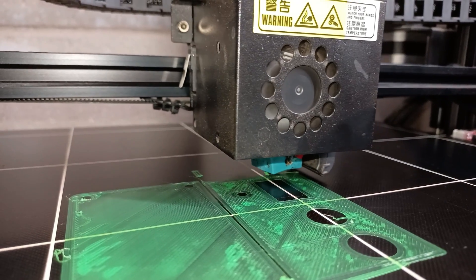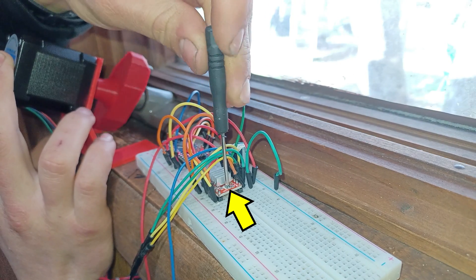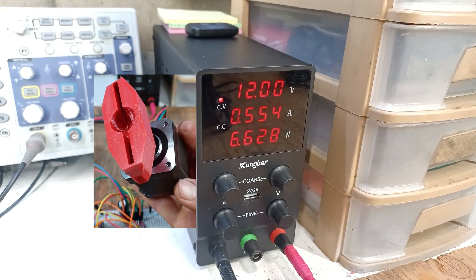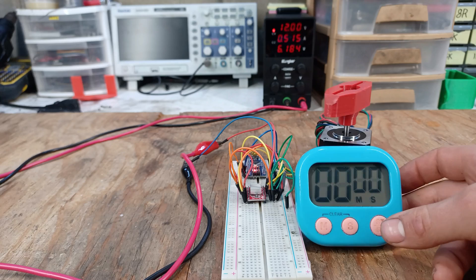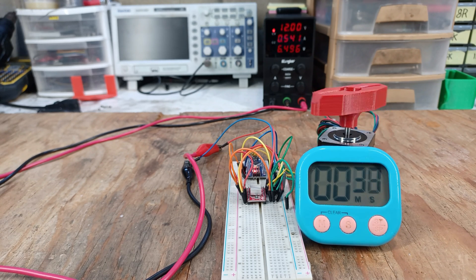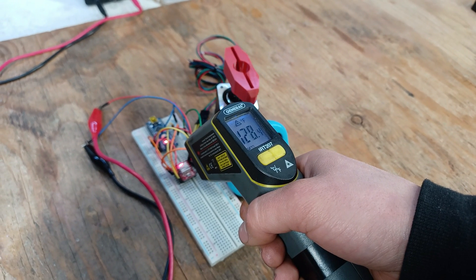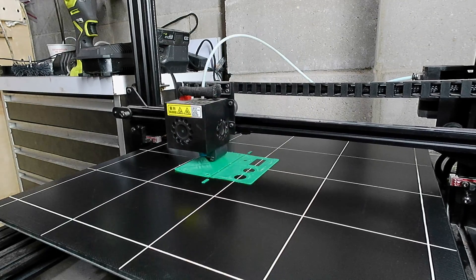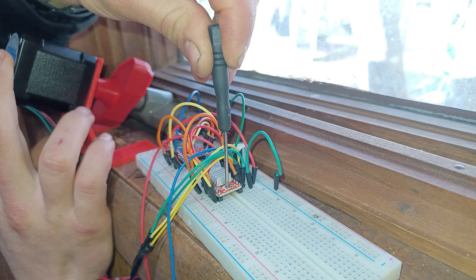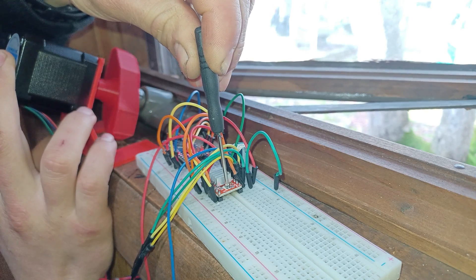As it is printing, I have to mention that the motor driver has a current regulation feature. Stepper motors draw constant current even when not under load. While letting the stepper motor run continuously for 3 minutes — an example of a child running it for a long time — the motor driver reached a temperature of 128 degrees Fahrenheit. Since it will be installed in an enclosure, I played around with the current potentiometer until I found the sweet spot about in the center, where it won't become too hot while having enough torque to open or close the window.